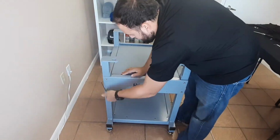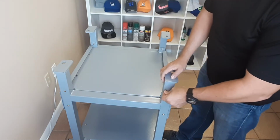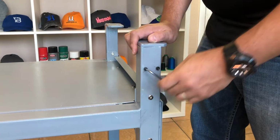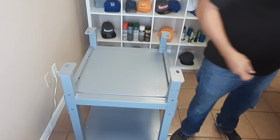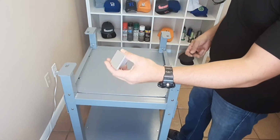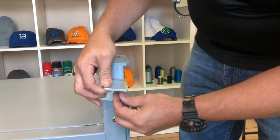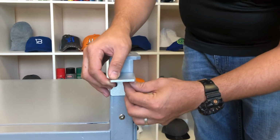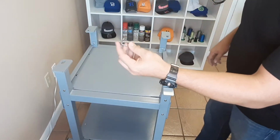You may now locate the 2 screw holes for the cap station bracket. Loosen and remove the hex screws attached to the holes. Place the bracket in front of the holes and attach to the stand by using the same hex bolts that you removed previously. You may torque the 2 screws down using a 4mm hex wrench.